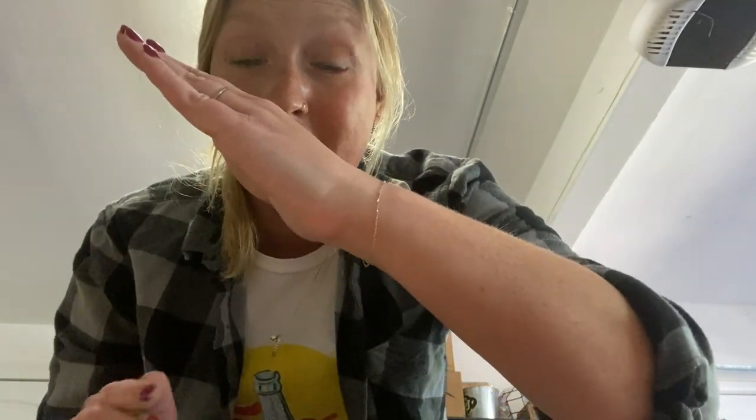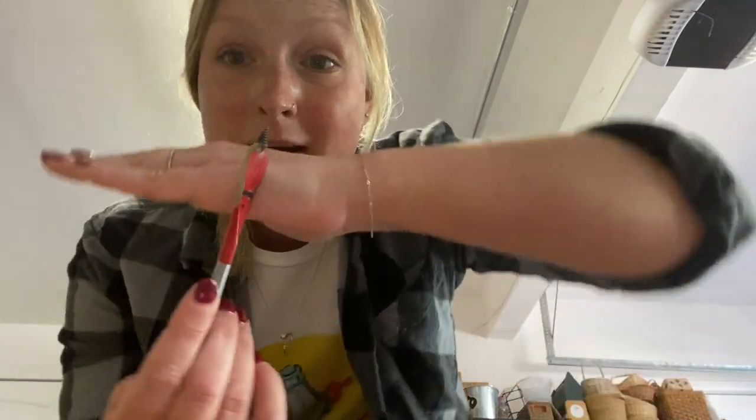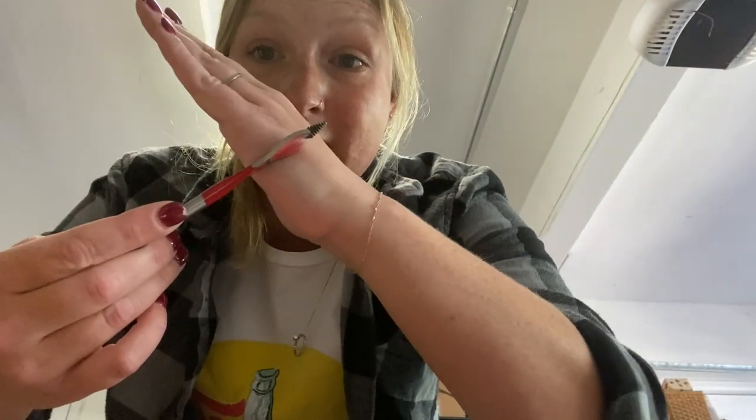That's not the case here because our railing is going to be at an angle. If we were to drill straight in, it would not be at the right angle. The balusters are going to be going at an angle, so we have to cut into this railing at an angle so that it will properly align with the balusters and they will stay plumb.